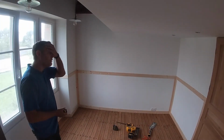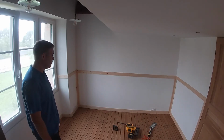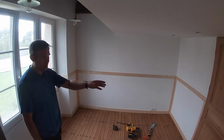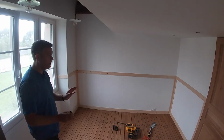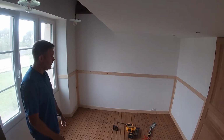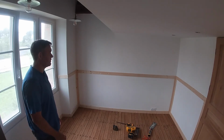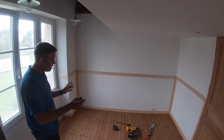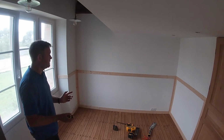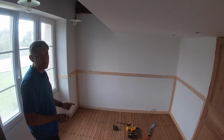Looking at it, I think probably around 60 centimetres is going to be just about right for the big walls and those 2 back walls. But obviously you can't just do 60 because that's not divisible by 60. So 60 is a rough size, but we want all the panels to be the same size. So the way you do this is measure the entire length and then work out how many 60 panels you can have in that length.